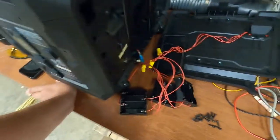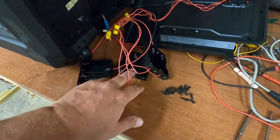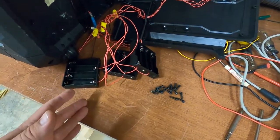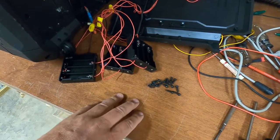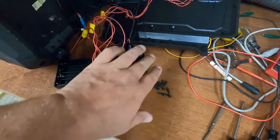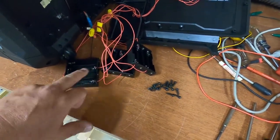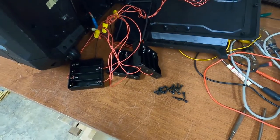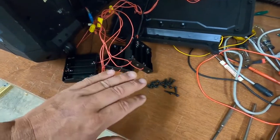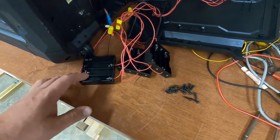So anyhow, charging is one thing, powering the device is another. So these are three series banks. And then the banks are in parallel. So these three batteries are in series. That makes your 11.1 volts, 11.1 volts, 11.1 volts. These individual pieces are then running parallel. So you get three times the capacity. It's still 11.1 volts. So that's the plan.